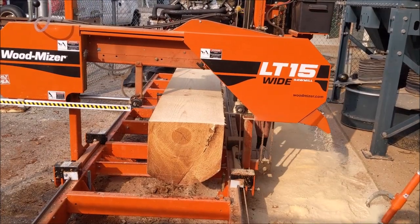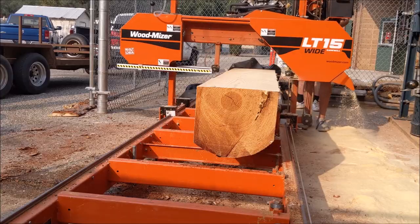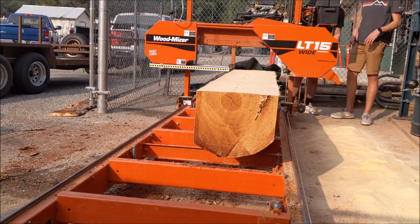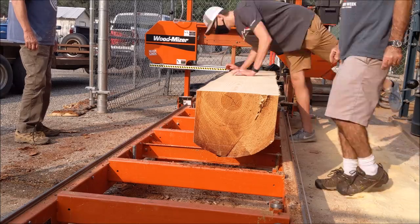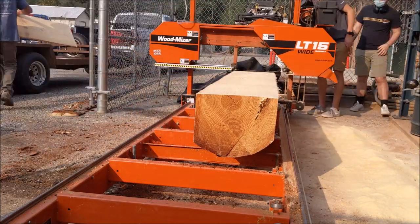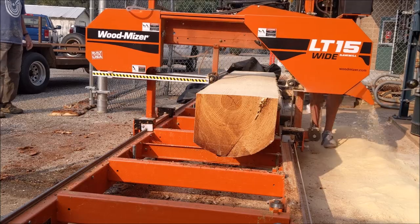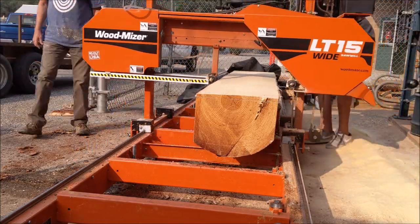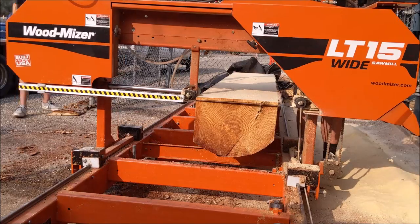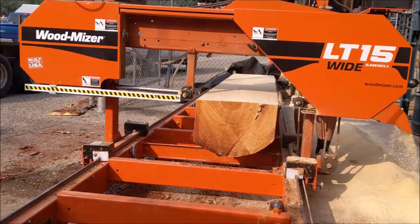Now we have a cant cut on all three sides and we're cutting out three-quarter inch slabs — a little under 16 inches, probably 15. Here I've turned it up to 10x time-lapse and you can see the students are really getting it done. The 70% rule is a good rule to know: if your diameter is 22 inches, 70% of that is about 15 to 16 inches — so 16 from 22 is six, meaning we only want to come down about three inches on each side. We're hoping to get seven to eight inch wide lap siding for the barn. If we could get them to 15 or 16 inches, you could rip them on the table saw rather than do it here.